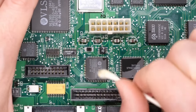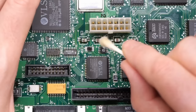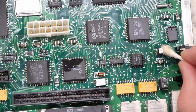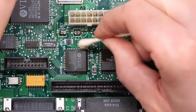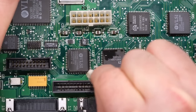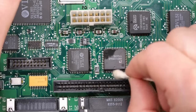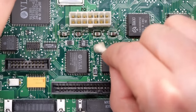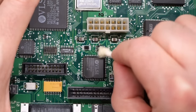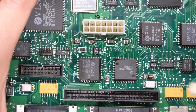Incidentally, the other type of cap you could use when redoing these boards are tantalums. And that's one right there, this black one. Why didn't Apple use these all around? Who knows? These types of caps over here are just cheaper. So I'm assuming this was a cost-cutting measure. Some of the early Mac IICIs and the Macintosh II boards were entirely tantalums, and they were very expensive computers. So I'm assuming, yeah, it was just purely cost-cutting. If they had used those, there's a good chance that there would be no damage to any of these boards, and all we might have is some shorted caps here or there, which is no big deal.